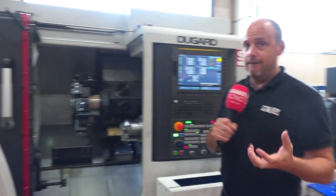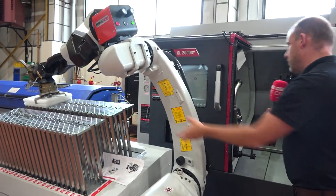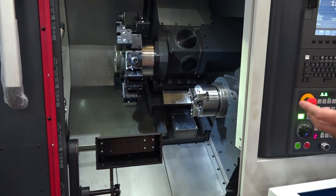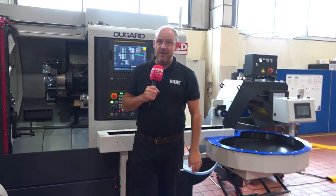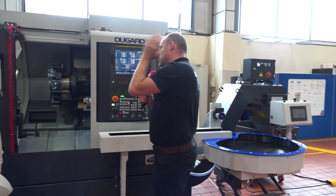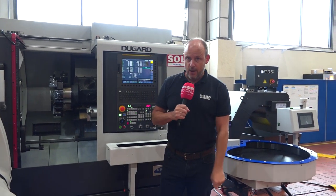It can be used as a conventional turning centre. By having this system, what they'll do is load the parts from the RoboJob into the machine, machine on the main spindle, then finish the second operation on the sub spindle. The RoboJob will then take the component out and stack it on a pallet neatly in front of the machine. Then, say Stuart gets a different requirement for a longer running job — he has a two-meter bar feed attached, so he can go from one operating method to the other very quickly.